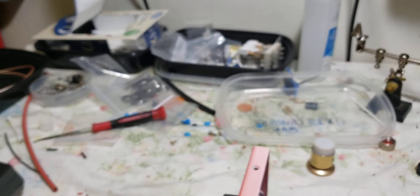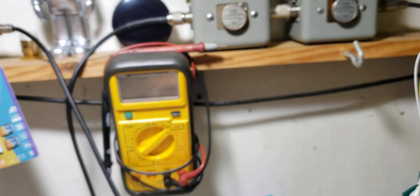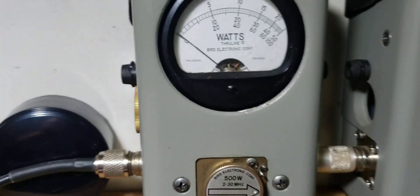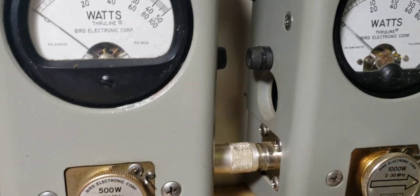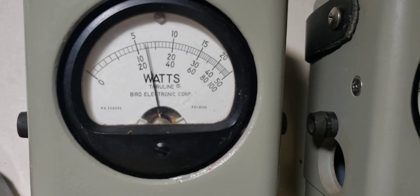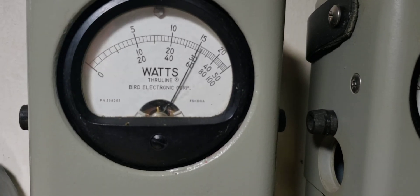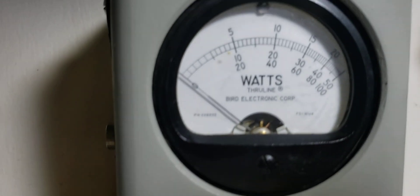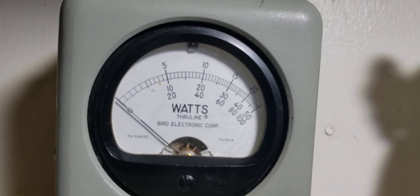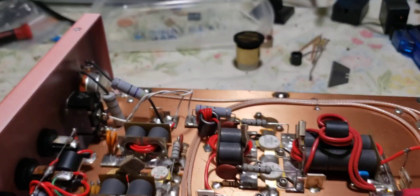Alright, let's take that out and put the 500-watt slug in. Basically now we're just showing you what the amp is doing since it's staged — has it lost a little bit of power? Maybe a tad bit; we'll have to compare it with the last video. 500-watt slug reading the middle scale — that right there is an easy 320 watts. And now take a look at this input reflect — that is even better than the one transistor section. Beautiful. This thing is working wonderful, and that's on 14.4 volts.